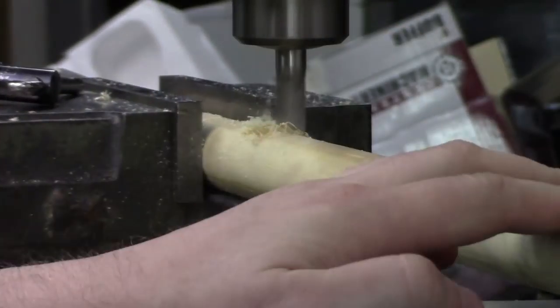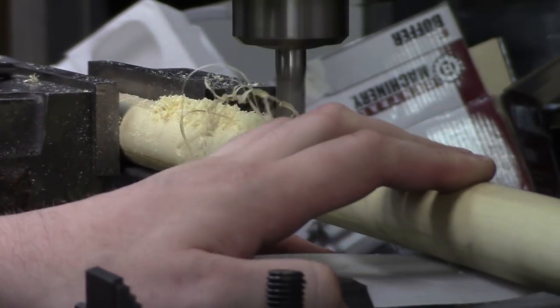I'm going to be starting with an inch and a quarter pine dowel as the centerpiece of the mace, which will form the handle and the main stalk of it, and we are going to go ahead and start machining five sides flat on a portion of it, because from what I can tell from the tiny little picture you have on the item, it looks like Dune Kubiari is a five-flange mace, so we're going to start by turning part of this dowel into a pentagon.